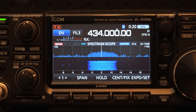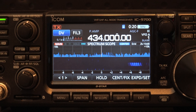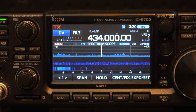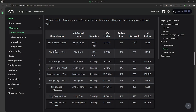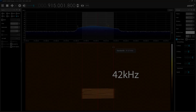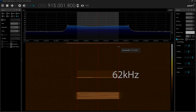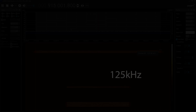I mainly wanted to check if there were any significant distance benefits to the LoRa protocol with these radios, but I believe they're using shorter-range LoRa settings to allow for voice communication. They provided me with the spreading factor and bandwidth settings but not the code rate — they're using a spreading factor of 7 and 250 kHz of bandwidth. Comparing to the Meshtastic modem preset chart, settings at or near a spreading factor of 7 and bandwidth of 250 kHz are the fastest but shorter range. If you'd like to learn more about LoRa, we've done a deep dive video into the various LoRa settings — while made with Meshtastic in mind, the same LoRa principles apply to these radios. I'll link that video in the description below.